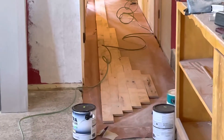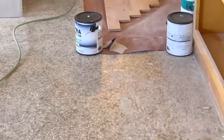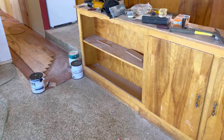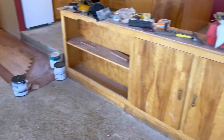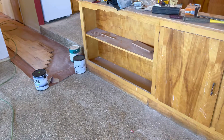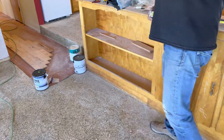What I did was pull my line and make sure it's equal distance off of that portion of the wall and this portion. Because this cabinet is temporarily here — and will be gone — I checked it off of the toe kick at the bottom of the cabinet. You could pull off it anywhere, but the toe kick is right here — hence, toe kick.